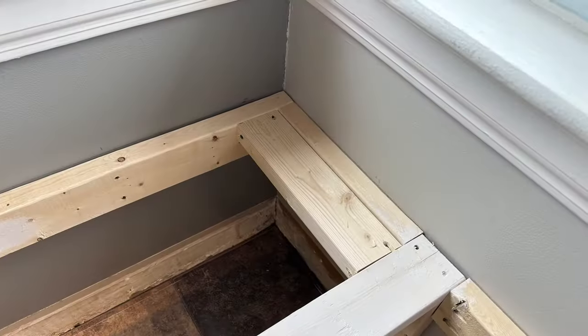Now I'm applying 3 coats of polyurethane by Behr, and I'm allowing it to dry between each coat. This is a water base and it dries very quickly, within an hour. So it's very pleasant to deal with this product, not to mention that this product has a matte finish, so there's no shine to it at all, which is what I love.